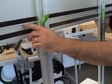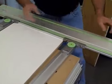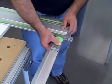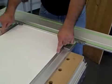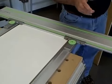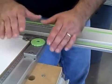You have this cam lock right here, and you have a T-nut that fits in there and also right here. So it doesn't matter what size guide rail I put this on. As I slide off, you see I have the T-nut here and this extrusion locks on the top part here. So when I slide that on and flip it up, it doesn't have to be snug against there. Now, what I have here are two screws. You don't necessarily have to tighten those, but if there are variances in this extrusion, I could take those and tighten them to eliminate the variance.